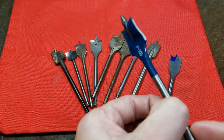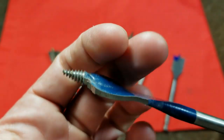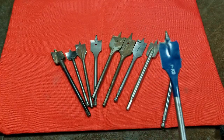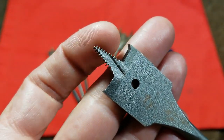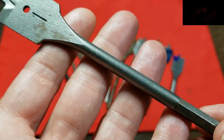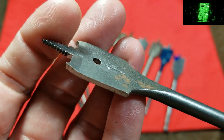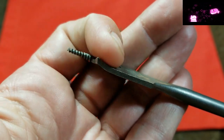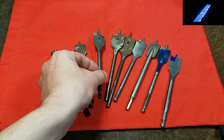I did just review these Bosch Daredevils. These are indeed forged because they have to hammer out this shape, and they are self-feed. These are probably some of the best of the modern bits that you can currently get. Here's what the older Bosch bits look like — they've been doing that self-feed design, but they used to be a bit cheaper. They're still pretty nice. They had the nice pre-cutting tips, some nice folding there, and instead of the stamping it maintains a full cross-section. And then of course the coarse self-feed tip.